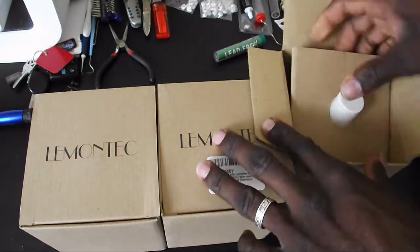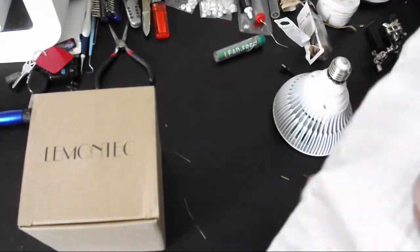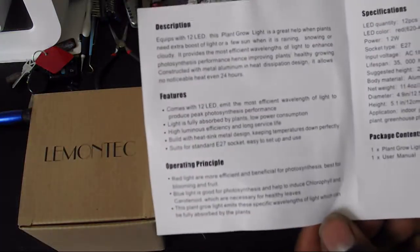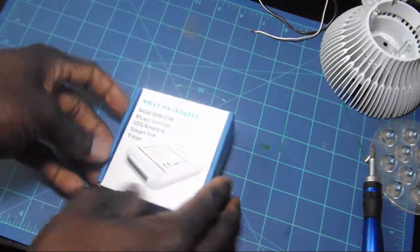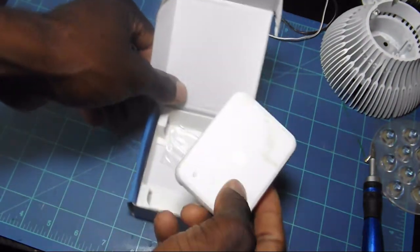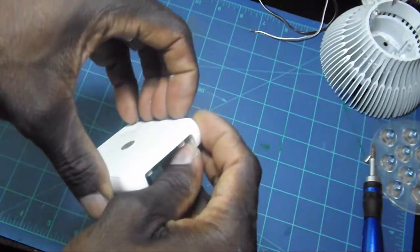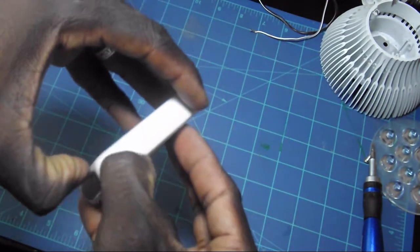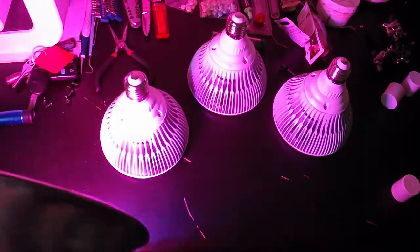There are two main parts of this build. First, a Lumotech LED grow light which has 12 LED diodes — 10 at 660 nanometer red, which I will be replacing, and 2 at 460 nanometer blue. The second component is a wireless controller for LED lights by a company called XC Source. It comes with an app which I think is really good. The only part I don't like is that it doesn't store your data when the electricity goes off. There is another one linked in the description which does have an internal battery to store data, and both are on Amazon for about $16.99.